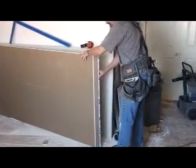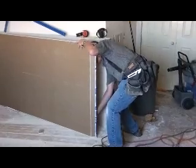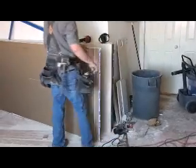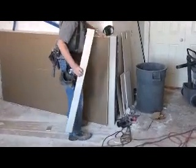With short pieces like this, you want to score the back side all the way from the bottom to the top before you snap it. But if it's a big piece, you can score just part of it instead.